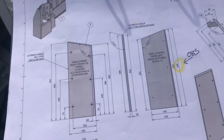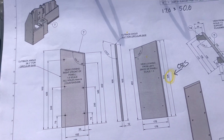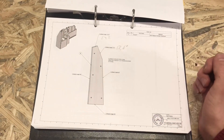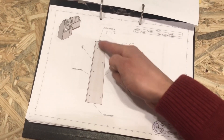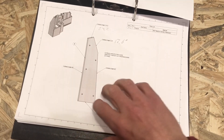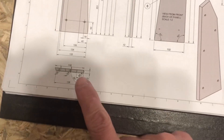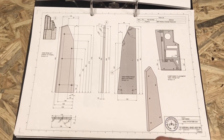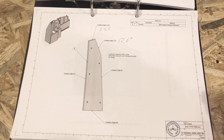This is number seven, and there are angles here and there. Be aware of the heights, because the height differs depending on how you're reading the drawing, so make sure you cut it at the correct height, otherwise you might cut it too short. Number eight is just a headache waiting to happen — you've got so many angles in different directions. Here you have an angle going one way, then an angle going the opposite direction, and then an angle that's at least 80 degrees. It's all three-dimensional and quite difficult to comprehend. Just stay true to the different drawings and things will eventually work out — take your time and it will be fine.